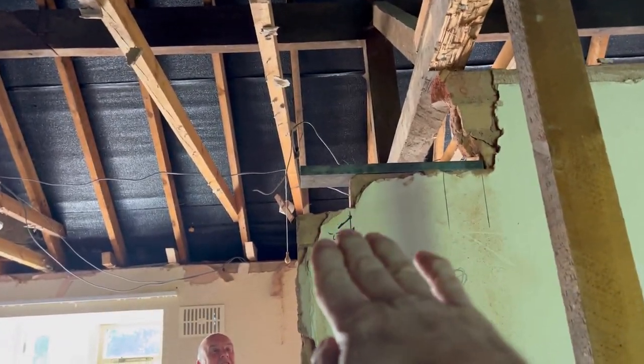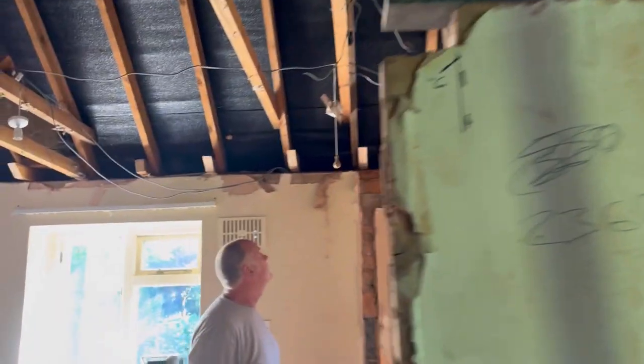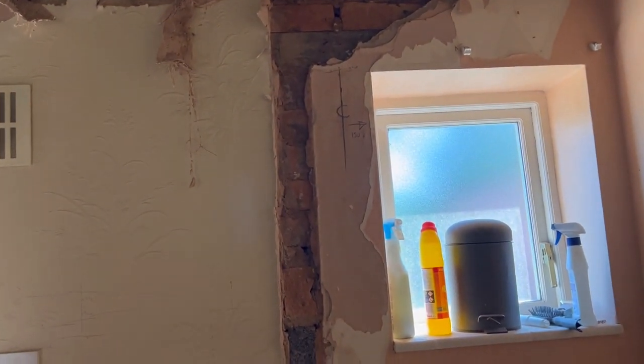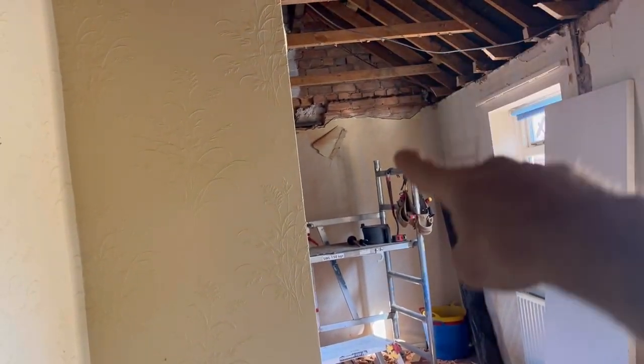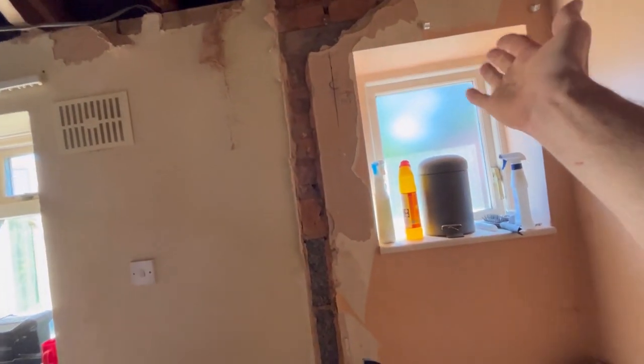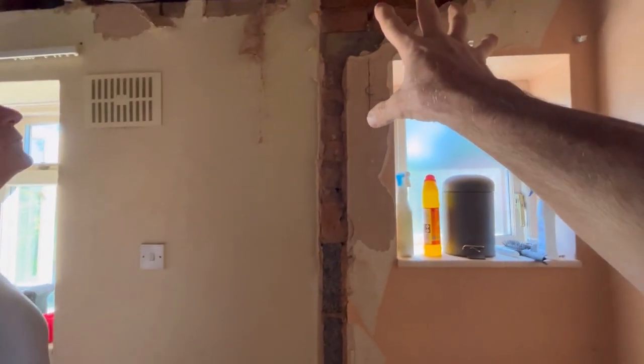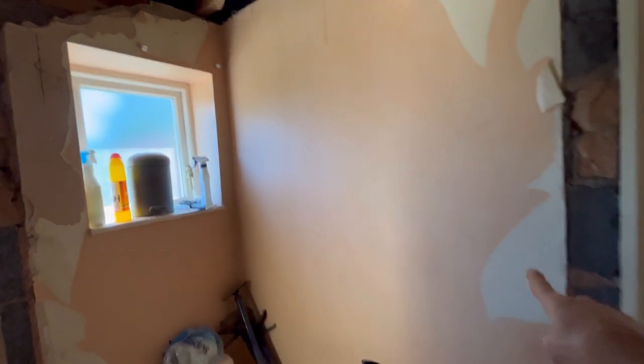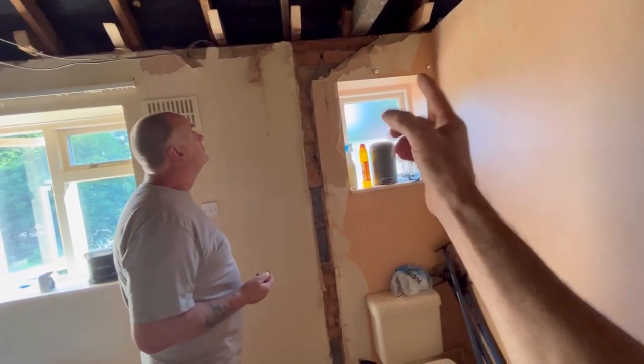Onto there, and then next to that, to the right-hand side, and then goes across onto there, is the other beam four, which is getting built into the wall as well, because if you remember from the last footage again, it's going below these purlin steels here. So we then said, well, we can't because we've got this wood lintel, we can't do that, but she wants this window going anyway, because this wall's coming out, that wall's coming out, the wall's going back here, what will be under the steel, and then that'll be a big bathroom then.